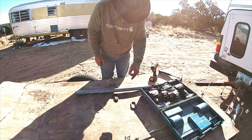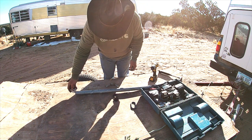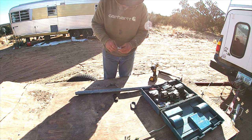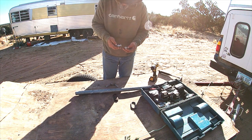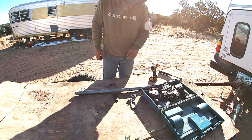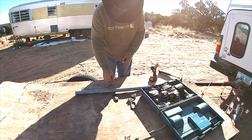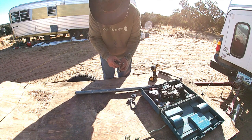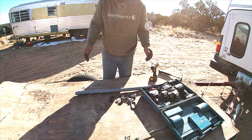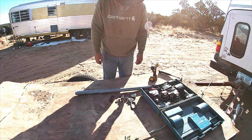I'm going to use that for my clevis ring and I'm going to be using these two small clevises to attach my tugs or my trace chains. I can take it loose, put it in the trace chain, tighten it back in there. I would really like if these were a hook, but I don't have any hooks, so I'm using what I got. I got to measure this, mark the center, and then I'll be drilling a hole for these bolts — putting them through these two on top and bottom. That's going to make my clevis.